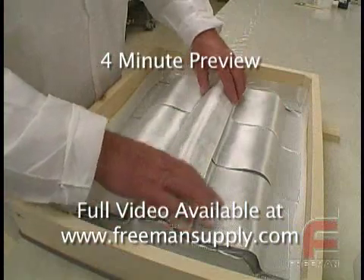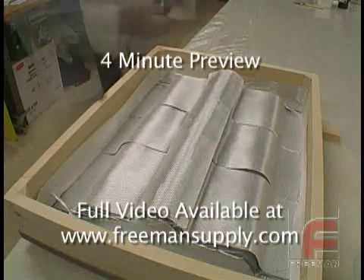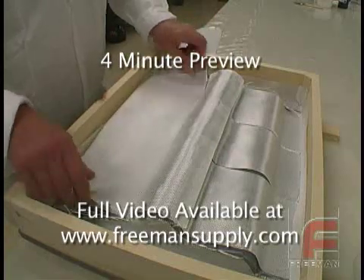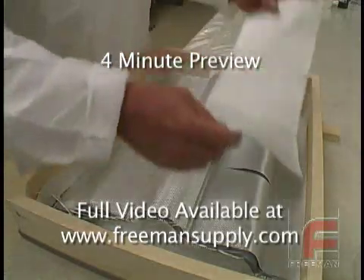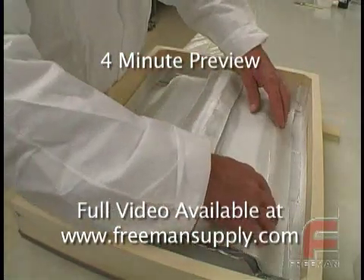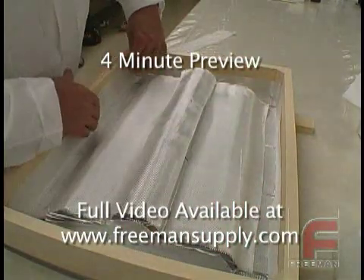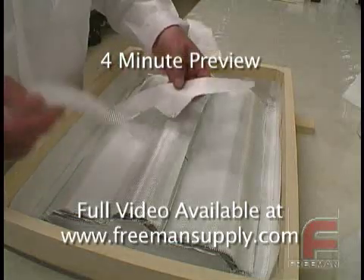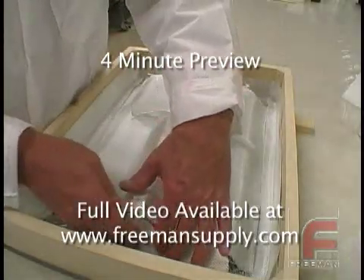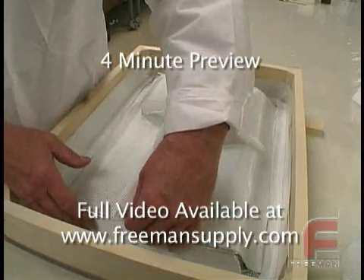Now we are ready for cutting the second layer, which we build up at a 90 degree angle from our first layer. Orientation of the cloth isn't as important for a mold as it is for a part, but it is usually good practice to at least alternate the direction of the fiberglass with each layer. We are also using wider tape at the perimeter to overlap the underlying layers. It is not required to have the first layer underneath in order to fit the second layer, but we are doing it this way in order to help you better visualize the construction of this tool.